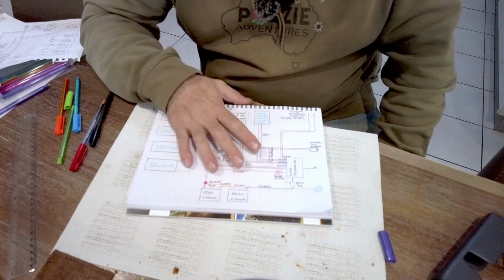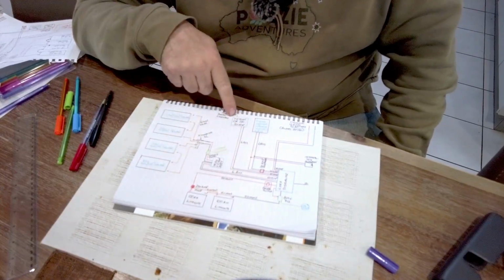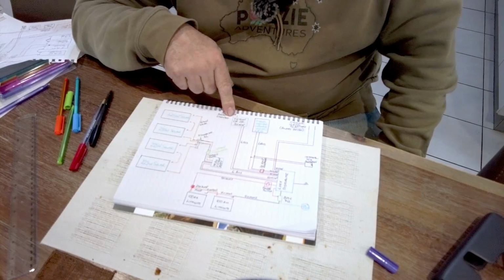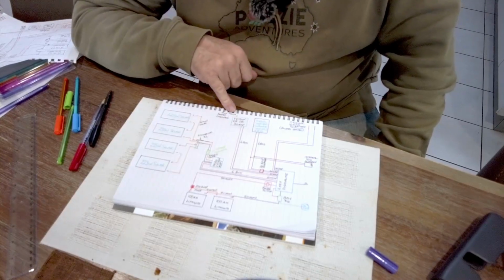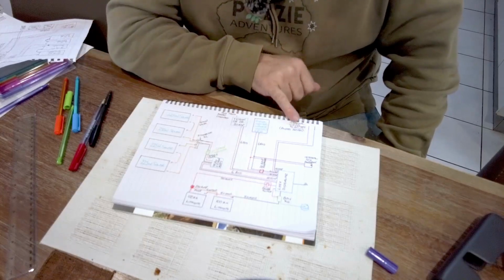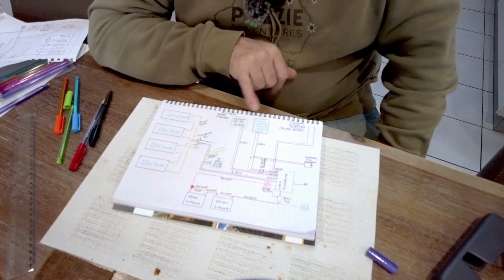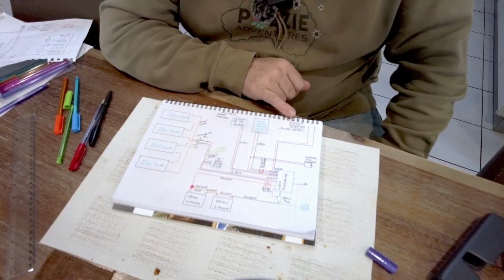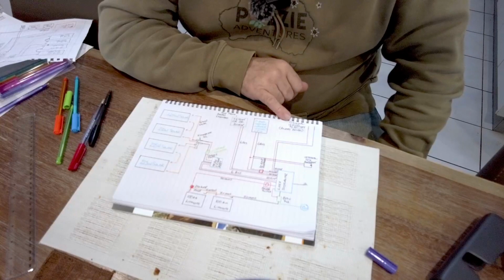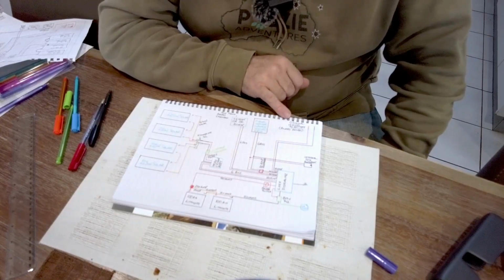We also need to look at, from there, we've got a DC-DC charger. Now the DC-DC charger is a Victron unit. It will need to take the supply from the auxiliary input that goes to the BM Pro currently. So what I'll be doing is removing that, because the BM Pro doesn't have a DC-DC built in. It's just a voltage sensing relay, which is a poor way to charge a lithium.